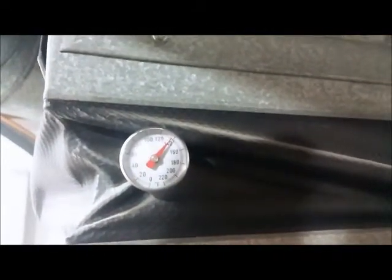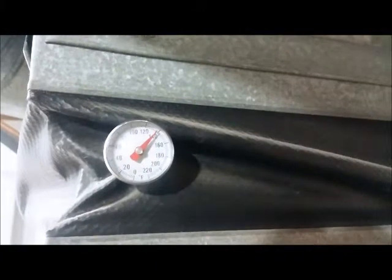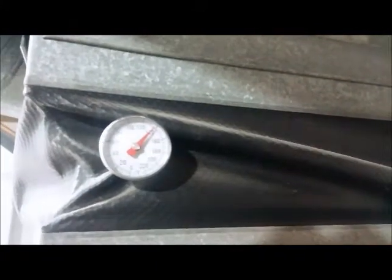She's dropped 5 degrees already, so let's get the filter back in there. The air flow points it at the furnace, and hopefully this will continue to drop. We'd like to see that in between our 35 and 65 degree range, which would be maybe 130 to 135 max.